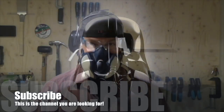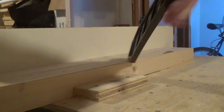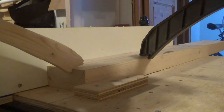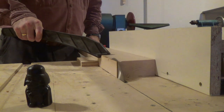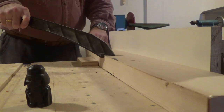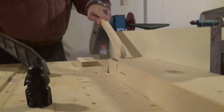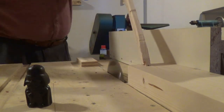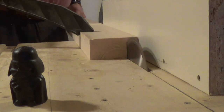I am Nomad Makes. Using the narrow rip trick I learned from Keith Brown at Rag & Bone Brown, I took off the rounded edges of the construction timber. You simply set up a stop block for a very narrow rip and then keep adjusting the fence as needed. And then I could rip the bracings down to their final dimensions.